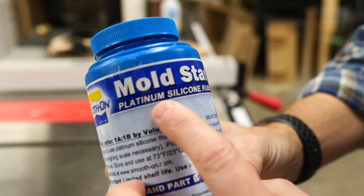A couple of downsides of tin cured silicone are that it's more likely to tear and has a shorter library life after it's cured. On the flip side, platinum cured silicones have a much longer library life, really low toxicity, and low shrinkage over time. The drawback is that platinum cured silicones react a lot more to sulfur in the object being molded — meaning the silicone won't fully cure and you'll end up with a really gooey mess. Most common modeling clays have sulfur, most resin prints from 3D printers or epoxy resins have sulfur, and you shouldn't use latex gloves to mix up your platinum cured silicones.